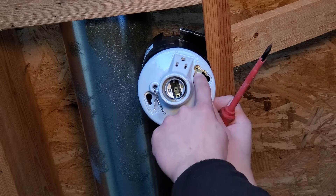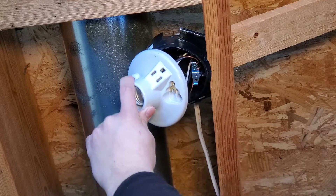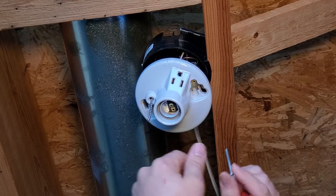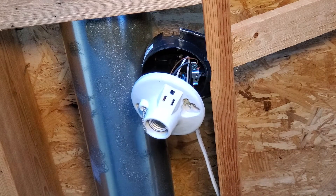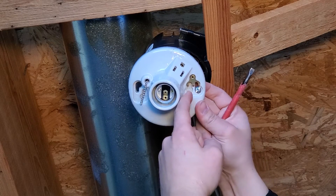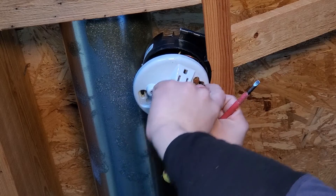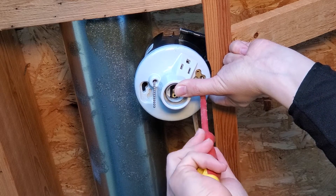You can see on this particular lamp base they actually give us a grounding tab here. With this, we may have been able to skip that solid connection, because you can see this metal up here would connect from these metal tabs using this screw, so our ground connection would have been made. But it's always better to connect to the pigtail and not rely on the screws, because the screws can come loose — it's just not as guaranteed to be a good solid connection. I'm actually threading my screw into the plastic of the box, so there will not be any continuity through that way. We'll be relying on the pigtail for our ground connection.